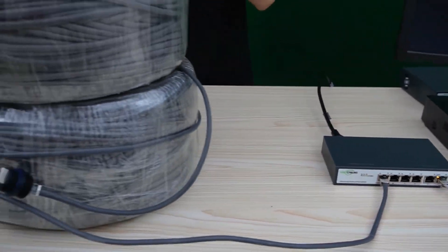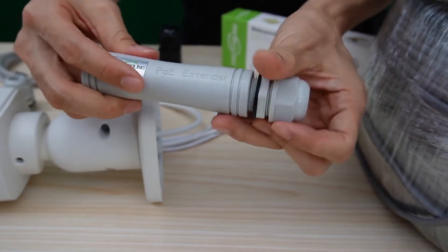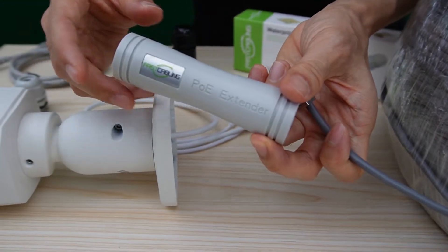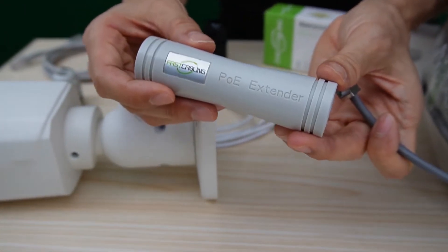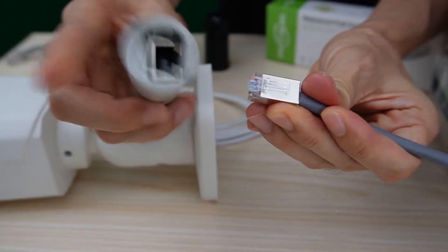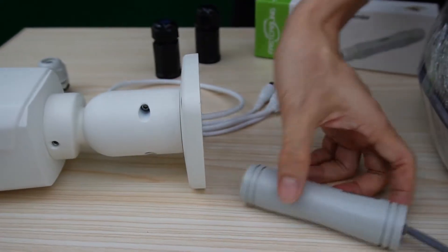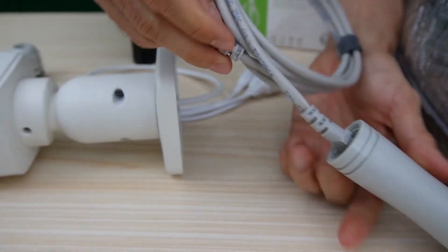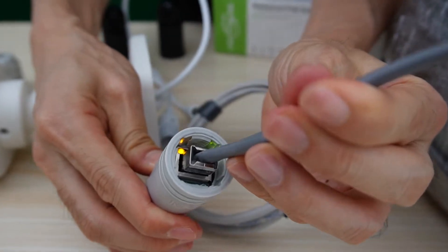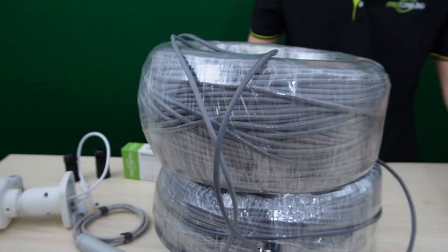Let's move to the camera. From the camera, I also need to use this PoE adapter. You may wonder why we still need a PoE adapter — the PoE switch can supply long run, but this is just a regular camera. We need to use this PoE adapter to return the signal up to 1,600 feet. Let's connect the long-run cable to the input port of the PoE adapter, and use a short patch cord to link the output port to the camera. You can see both indicators are on, which means the IP camera is communicating with this long-run PoE switch.